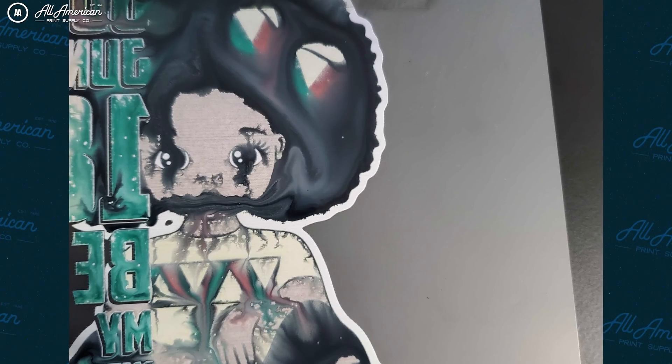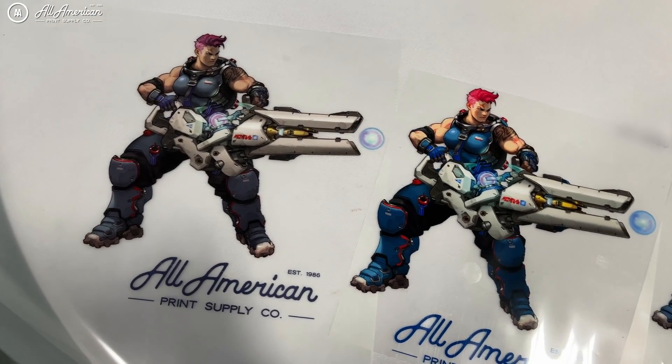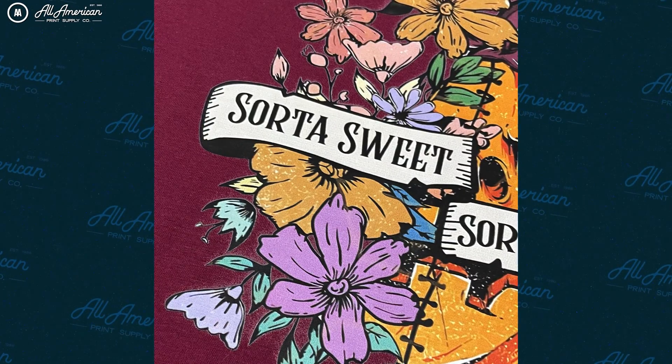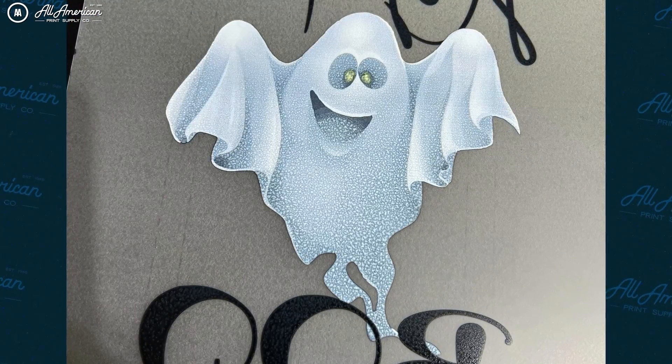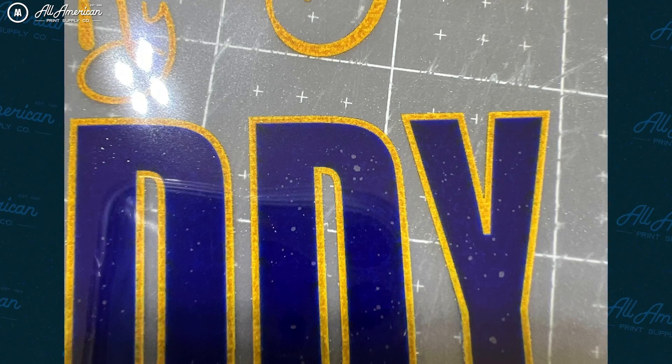Our final lesson of the year was the ink absorbing layer — I advise reviewing this, as it can literally make or break your entire DTF process. You can view the full lesson by clicking up here. In your DTF printing you may have noticed ink puddling or mixing, color inaccuracies compared to your file image, or white dots from the overprint showing through in your CMYK prints — all of these can be related to the ink absorbing layer. You want this layer not only evenly applied but properly coated to ensure the very best results.